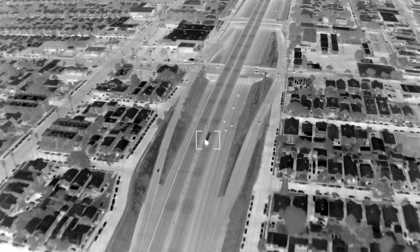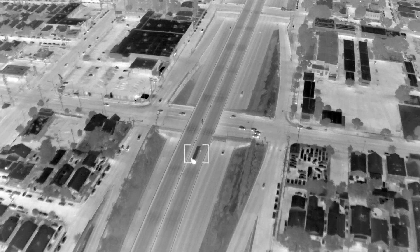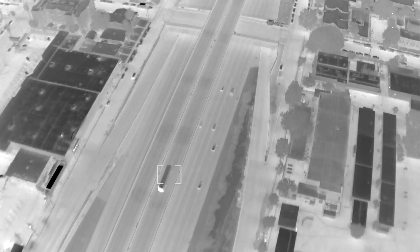The image processor has features supporting moving object detection and object tracking with closed-loop feedback for telemetry. That telemetry can be used to steer a gimbal, steer the platform, or simply find objects in the field.